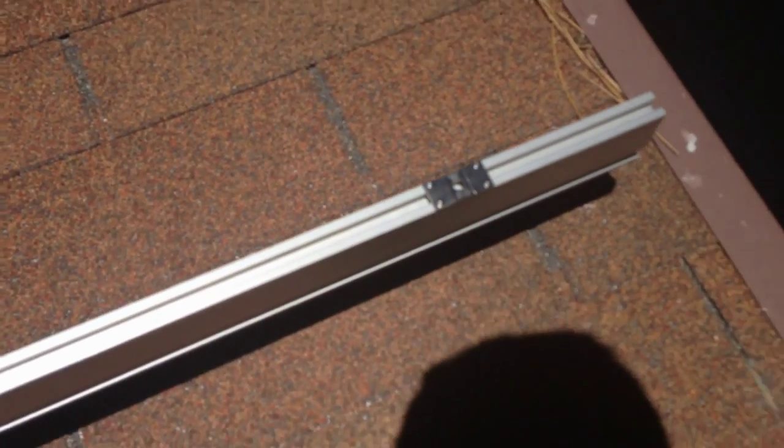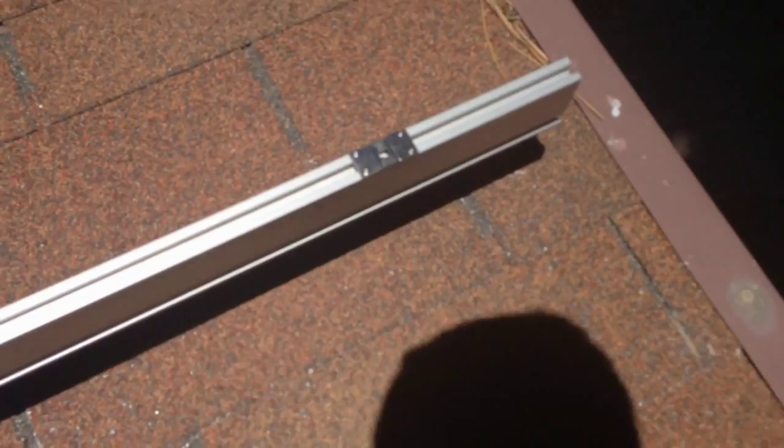You can see how I'm slipping it through each of these and screwing it in, but I'll wait on doing that until I finish mounting the panels. The panel's rail is going to rest on top of these — you can see those four little dots — and once the panels are tightened down, the compression from the mid clamps and end clamps will form the electrical bond. I'm sticking one on the other rail; there are little feet you just pop into the rails.